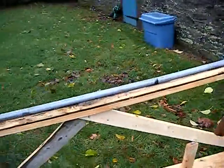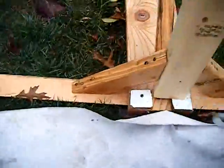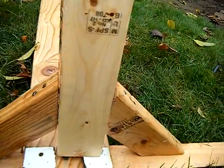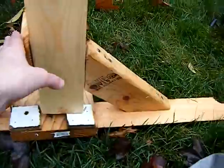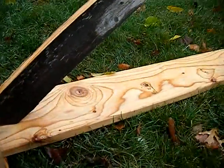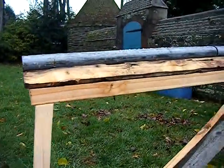For the legs, take some scrap or two-by-four and make some angles. You're going to want to cut all the pieces to the angles when you're putting them on — it just makes it better. Put a nail through the bottom and a nail on the side. I recommend attaching these to the same side and sliding it on, then attaching that. If you're building it in the basement, do the assembly outside. Start by attaching the two end braces, then attach the top, and cut the top piece on an angle.